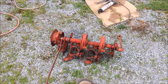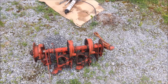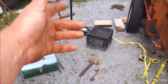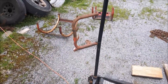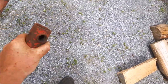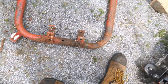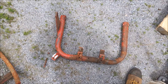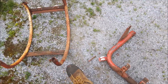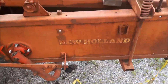I believe the 311 knotters are better than the original ones - these were old, we're talking 50s technology. These work good too, it's just that basically the biggest problem was that yoke was no good. You can still see where it's been bent before - you can tell. It's been tweaked before, this is where they straightened it. Even those bend marks shouldn't have been in there - I'm pretty sure that's how it should have been. We'll put that back on this one.